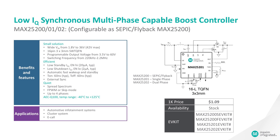This is a quick one-pager about the MAX25200, 01, and 02. The MAX25200 is a device that can be configured in either SEPIC or flyback configuration, while the MAX25201 and 25202 are made to be a synchronous boost controller. The input voltage range is 3 volts up to 36 volts, then 1.8 volts after startup. This device does have a 42 volt ABS max in a small 3 by 3 millimeter package.